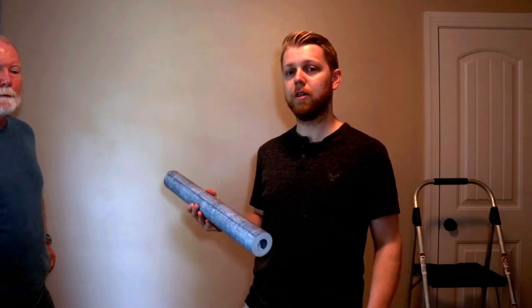Since Steve does wallpaper professionally, we're actually going to use a pasting machine. If you look on the label, it explains that you can also paste the wall to hang this wallpaper. If you're doing this as a DIY project, that's great — you roll the paste on the wall and hang your paper on top. If you're going to paste the wall, measure where the paper's going to hit and paste out maybe a couple inches beyond that so you've got the whole area covered.